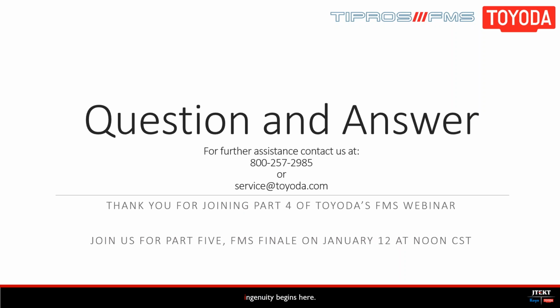So the first question we've got here is, do I need an M code in my program to use the first tool function? Yes, you do. It's an M75, and I think we're going to put an example on the web for you guys to look at how we should format our program. Okay.